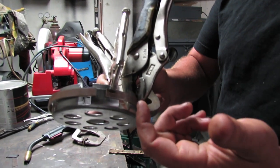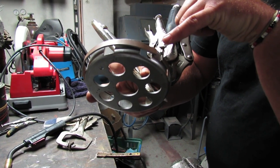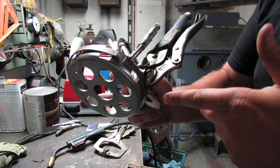I've already started clamping it. Tools required: about three decent vice grips. I'll usually clamp it right about a quarter of an inch from the top. What we're going to do is tack each spot and then do final welding once you actually put the outermost plate in.